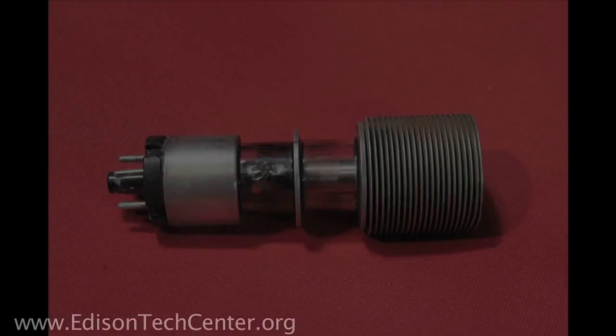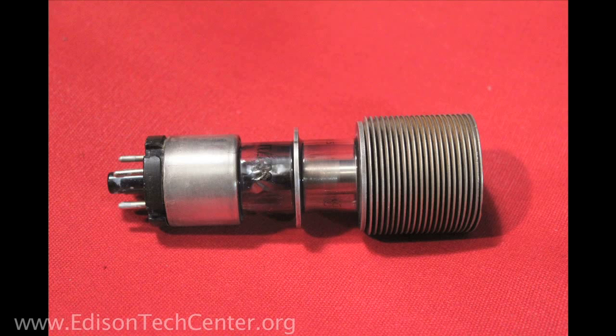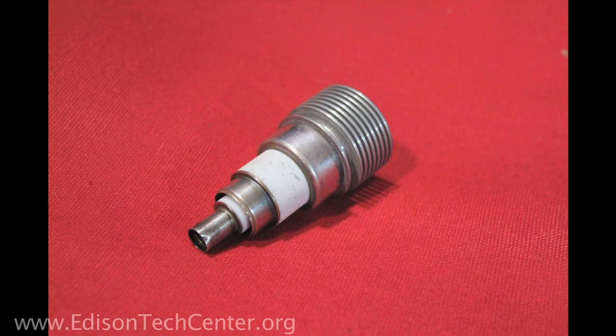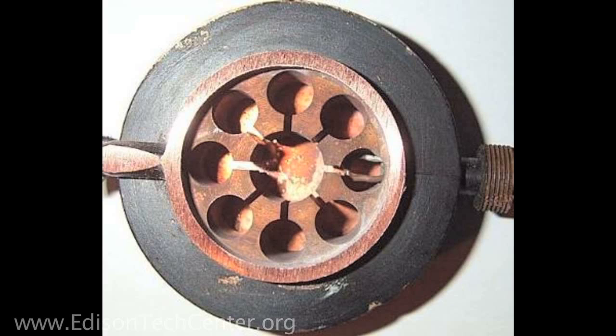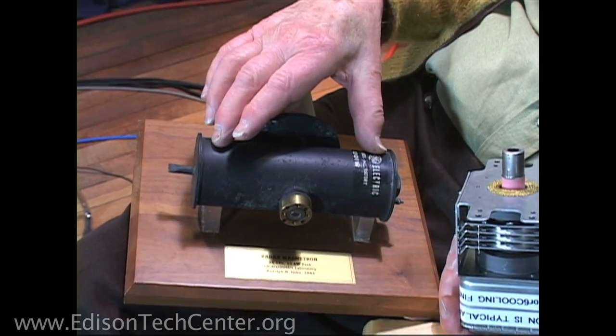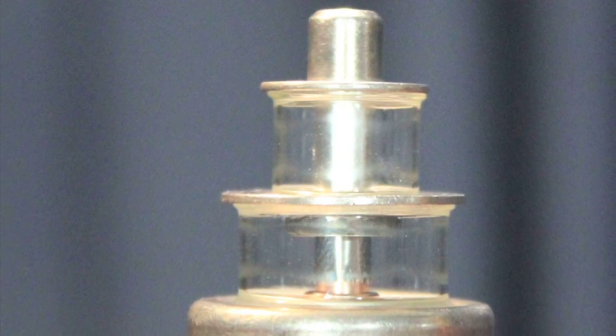That required an entirely new concept in tube manufacture, and in circuit design as well — instead of using wires, you had to use coaxial. We made various versions; this is a higher-power version, so they could also be used as transmitters. But the basic transmitter for the microwave radars was the magnetron, developed in England and implemented in the U.S. That's how Raytheon got started, and we were making them in Schenectady. The transmitter was typically a 10-kilowatt peak power magnetron paired with a lighthouse tube receiver.